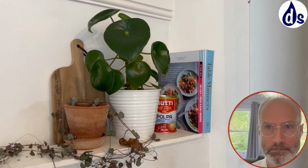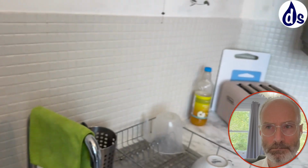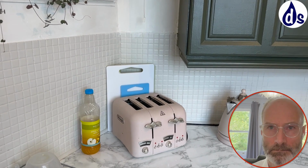But this is a chimney breast, and chimney breasts, when they were originally used for heating, would use coal, and coal can emit what are called hygroscopic salts. In particular calcium nitrate, which forms a form of condensation at 50% relative humidity. So you won't see that disappear until you drop the internal vapour levels below 50% for a prolonged period of time. And just like I was describing with the calibration jar, that salt has a specific relative humidity of 75%, so calcium nitrate has a specific relative humidity of 50%. And it comes from coal primarily, the burning of coal, historic, it's not current.